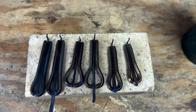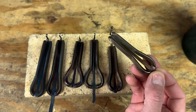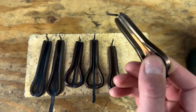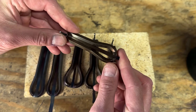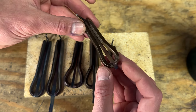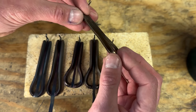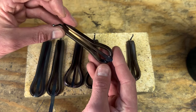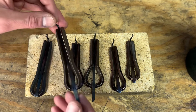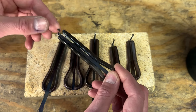We're going to first talk about how I've used heat coloring and then how to do it. Heat coloring is using metal and heat — here we're using a flame source like this torch — to color our metal. What it is is a healthy layer of oxidation. As the metal gets warmer the colors change: it'll change from the gunmetal gray color of the metal, first turning straw, then getting hints of purple, gradually more purple, until we get hints of blue, and finally at the highest temperatures you'll get a coal blue-gray color.